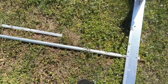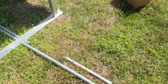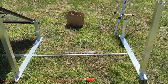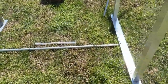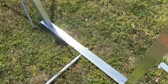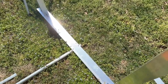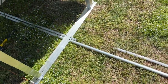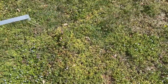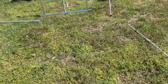For each rack, as you want to add another rack, you take your piece of EMT and thread it through as far as it needs to go so that this is the only rack it's connected to. Then you set your spacing between the two racks for your panel, and then you take it off and push the EMT in further so it's out of your way. Then you drill your holes for the spikes — which you've marked — tap your spikes in, then put the frame back in place, and then thread through your EMT pipe for the next rack and do the same procedure again.